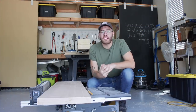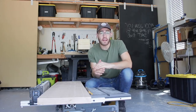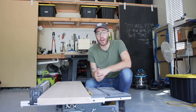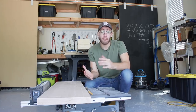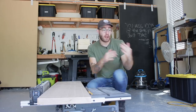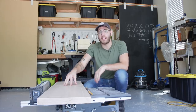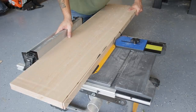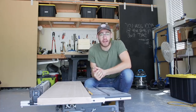Day three, and even though yesterday I wasn't able to get a completely successful bend, there were still some big improvements. I learned that bending slower was actually a little bit better — by doing that, I was able to get one of the bends on a couple of the boards to be perfect; I just wasn't able to get two bends on one board right. Now poplar is technically a hardwood, it just happens to be the softest of all the hardwoods. So instead of using those same boards today, I've got a piece of eight-quarter maple that I'm going to cut down into eighth-inch strips. These are slightly thinner than the poplar boards I was using, and this maple board has really straight grain, which hopefully will prevent a little bit of splitting.